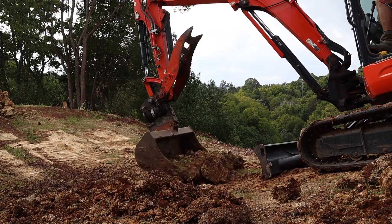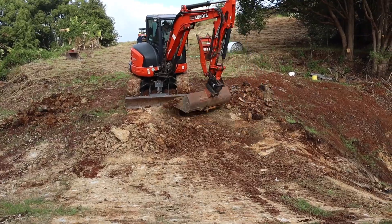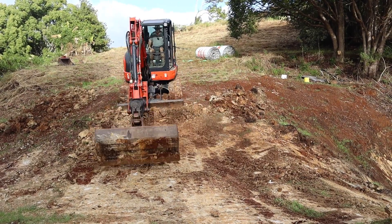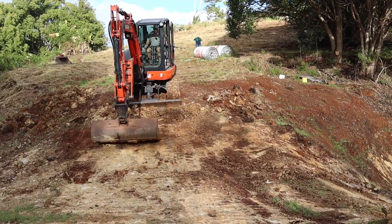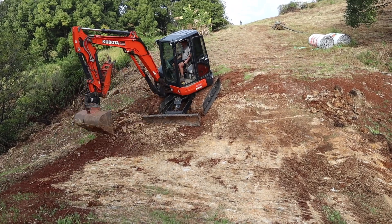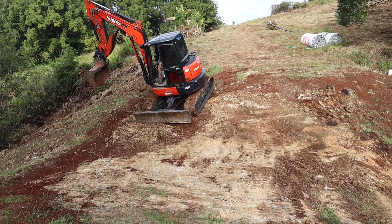This spillway is a bit of a compromise because it's got to be trafficable — you need to be able to drive vehicles over it. Ideally, as you were telling me off camera, the flatter the better, because you want to spread water out rather than concentrate it into one specific zone. Normally we would have done that but this time we're just going with a nice gentle dish.